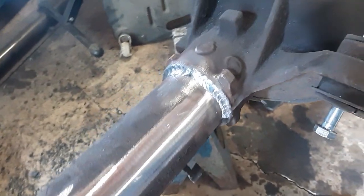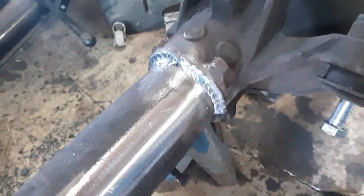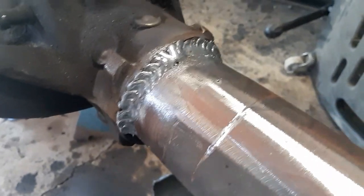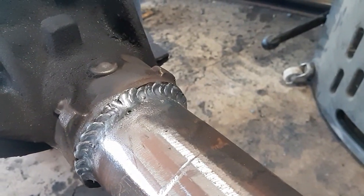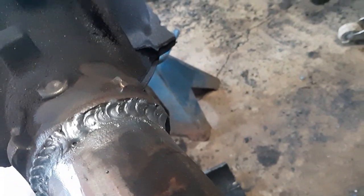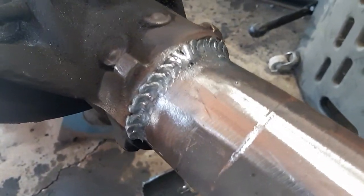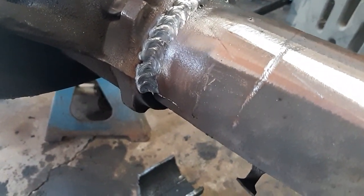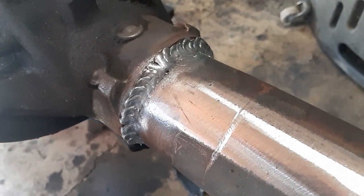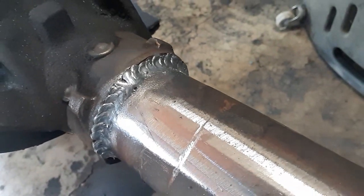And even after that, still sometimes you have problems. That one turned out all right. I had a little bit of spitting and spattering. This side was the same. I started out, it wasn't going too good. Made some adjustments on my machine, it did better. But with that cast metal, it'll soak up. It's very porous, and it'll soak up any kind of oils and such. Now, if I had my torch gauges, I would have probably preheated it, kind of burned off whatever's in there. But I've had better. I've had worse. I'll take in the middle.